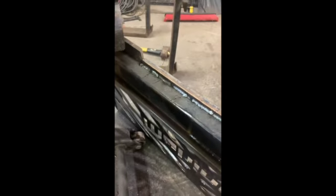We solid welded it on the bottom here, so it's not going to be giving out this time. Because that's where it gave out — it was missing welds. See how that doesn't have no weld there? That's where she gave out. So I'm going to grind that up and weld the whole thing.